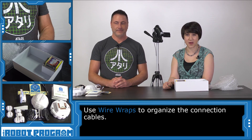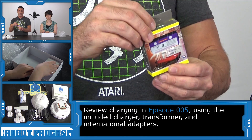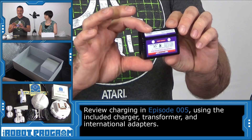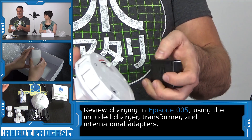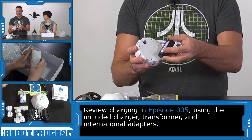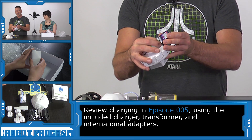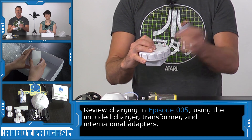At the beginning we talked about the importance of your batteries. Let's take a look at our battery components now. This is your battery charger — here you'll find the actual charger itself. You're going to want to plug this into the bottom of your robot. Under the bottom you have your battery cables coming out and you want to position it like so, just press it in with your finger. To disconnect it, simply grab it with two fingers, gently rock it out. Don't pull it by its wires and definitely don't just pull it straight out.